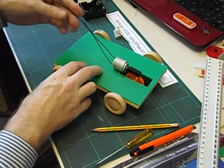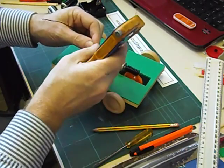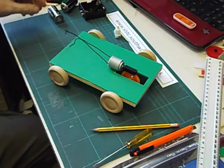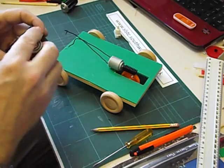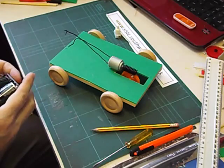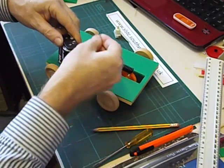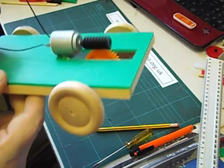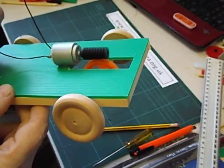We're now going to connect up the motor to a circuit — we just need to strip these wires. We're going to run it off 3 volts; we could use AA batteries in a double holder; I'm going to use C batteries in a double C holder. At this point we can check to see if it's working — if I just hold the wires on here, as you can see the worm gear is turning the spur gear at a slower speed but with lots of force.